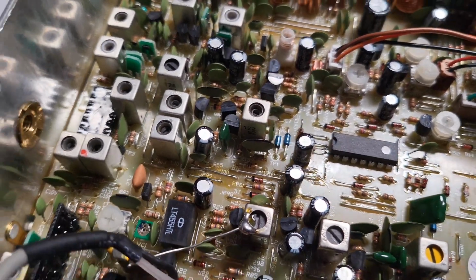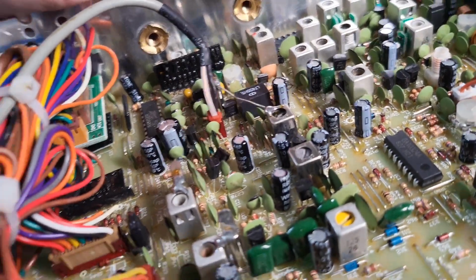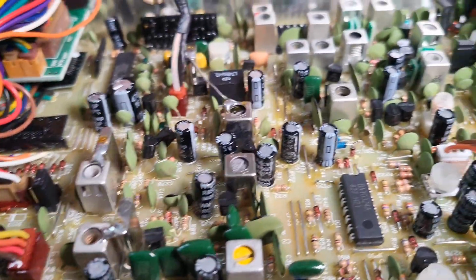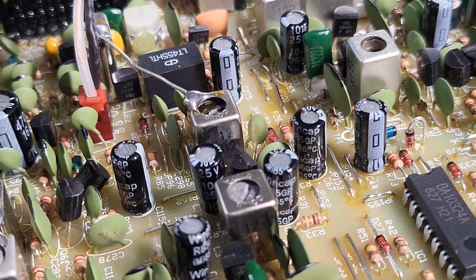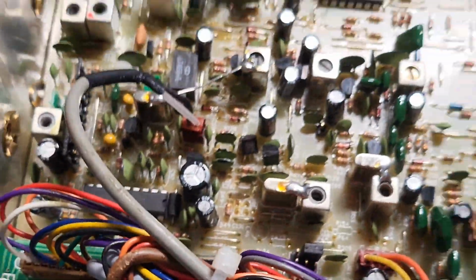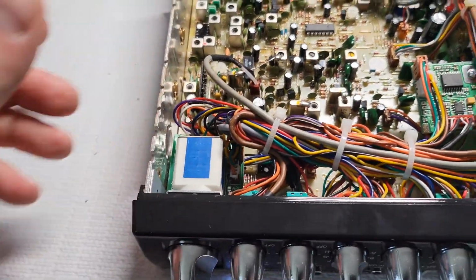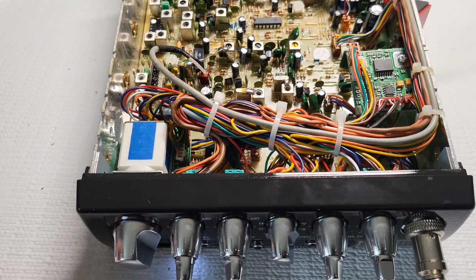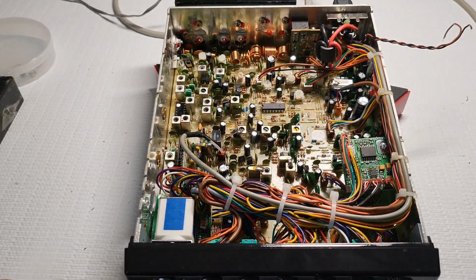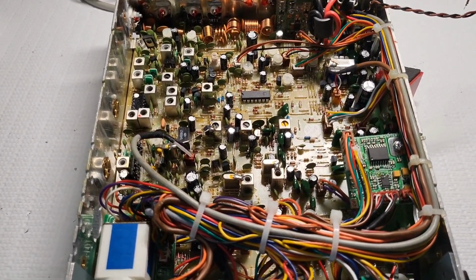But man, these caps, what are they called? What is that? WinCap. Let me try to zoom in on one of these. Yeah, if you look, it's called WinCap. Let me tell you something about WinCaps. If you guys are familiar with a website called badcaps.com, it's kind of like a forum, and you can do a search. I used to post on there a while back, just people's experiences with caps and whatnot, and they call out sketchy companies. WinCap is one of those companies.